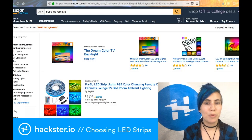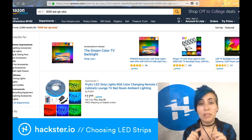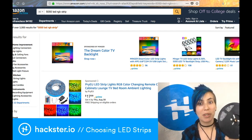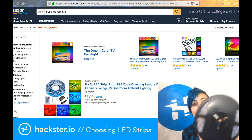You can find lots of varieties of these by searching on Amazon for 5050 RGB LED strip. The 5050 refers to the size of the LED, which is 5 by 5 millimeters — which also happens to apply to NeoPixels, though they're less frequently described that way and more often referred to as WS2812s.